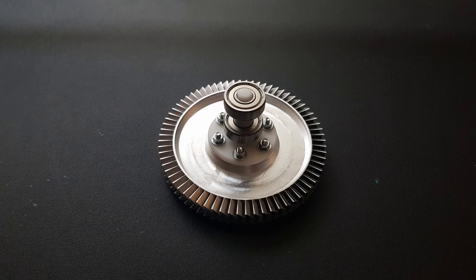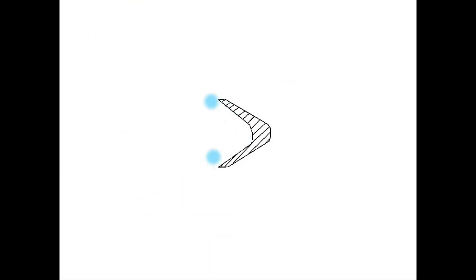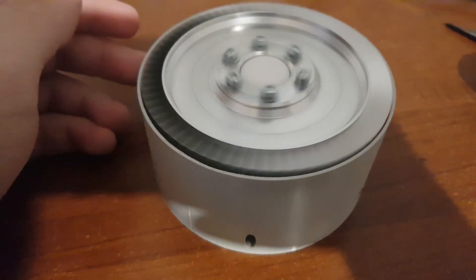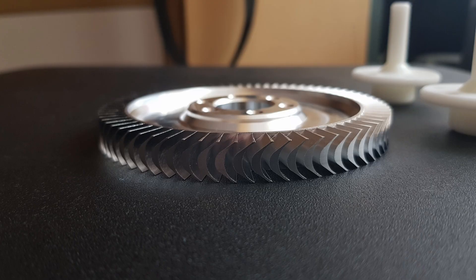This was the moment I discovered a quite interesting but annoying inefficiency I named centrifugal drag. At the high speeds that this turbine is intended to work at, the blades act like a centrifugal pump where they fling the air outwards and pull air in from the top and bottom. To fix this I had to design a simple case that would prevent the air from getting flung outwards in the first place. By this point, the load tolerances and high strength of a machined turbine really started to look interesting.